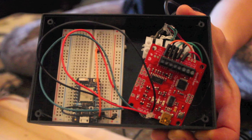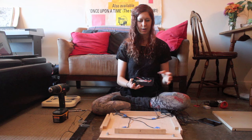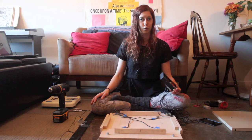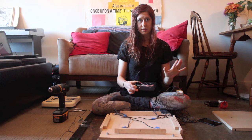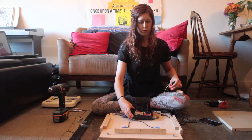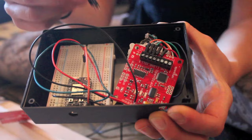What's really awesome is that there is a place where you can power the OpenScale with a battery, so you can make this all wireless. And if you really want to go crazy, you can make it run off renewable energy too. I'm going to show you really quickly how to power it with a battery. Both of these boards are USB, so we need five volts. SparkFun makes a bunch of boards that can help us do this. This is a board called the SunnyBuddy, and it's meant for photovoltaics or solar panels, but we can use it for this project by just connecting the output of this to the power for our OpenScale.